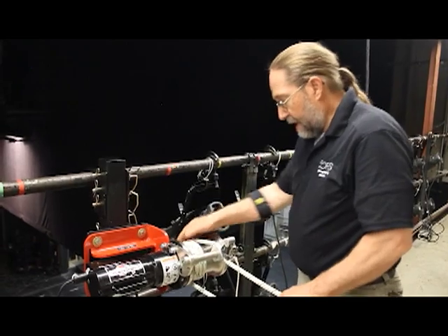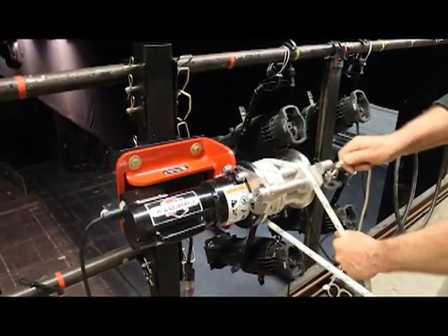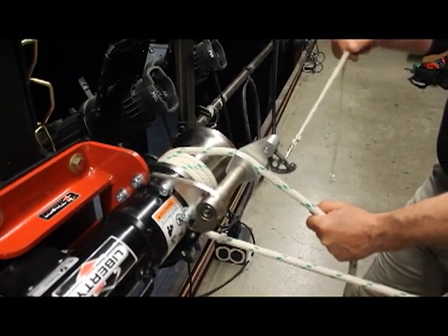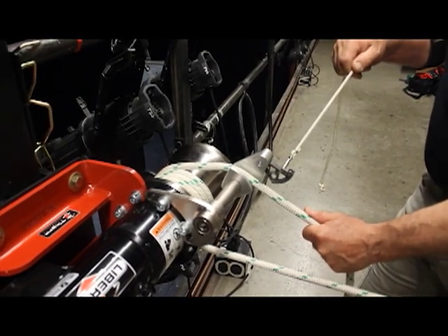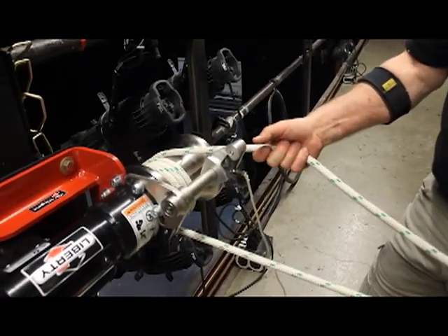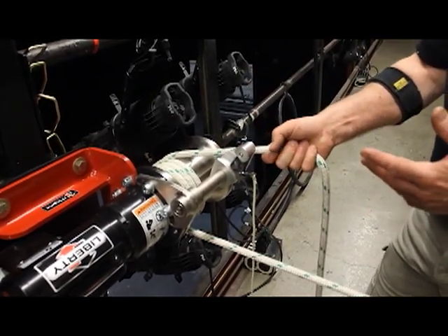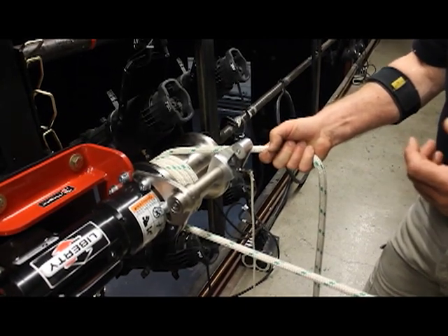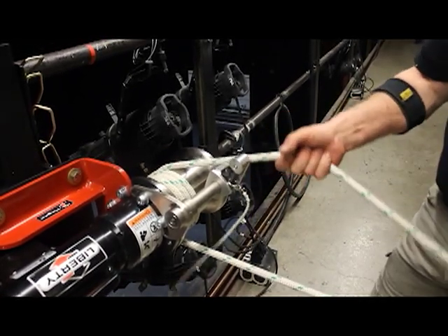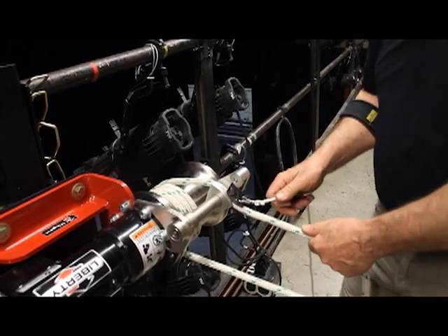In this case, I'm going to go ahead and use this winch, which comes from Thern Incorporated. It has a spring-loaded lock on the rope. You could run it with one hand on the rope and one hand on the lock. If you have sufficient experience and are comfortable with the load, it's easier to operate with it out of the lock. This defeats one of the safety features, but practically speaking, is not an uncommon thing to do in day-to-day operations — though we might use the lock to secure it if we're pausing for a few minutes.